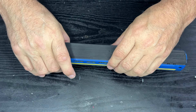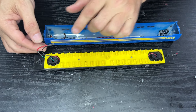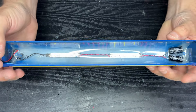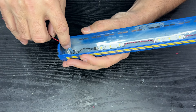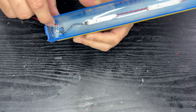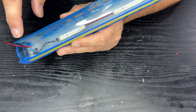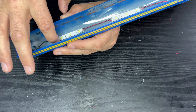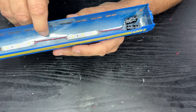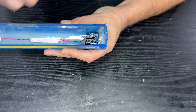So I have all my lighting and circuitry installed on the roof itself, connected with a little micro plug so we can move that out the way. Here you can see what I made. Starting from this side, we've got a little potentiometer or trim pot — adjustable resistor basically. That goes along to a bridge rectifier to convert AC to DC and also to make sure the voltage is always going in positive-negative into the LED system. Three LEDs with a little resistor, a little extension wire, another three LEDs with a little resistor, another extension wire, and two capacitors. And that's the problem.